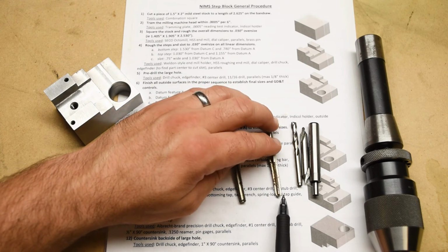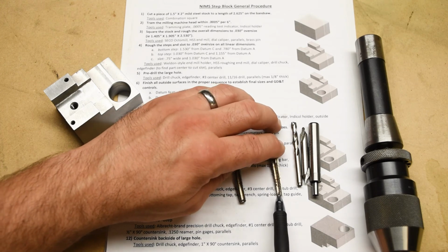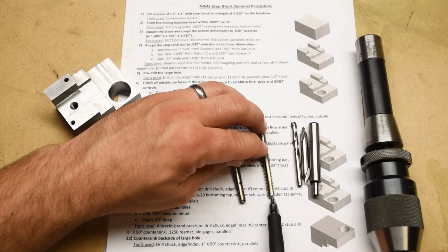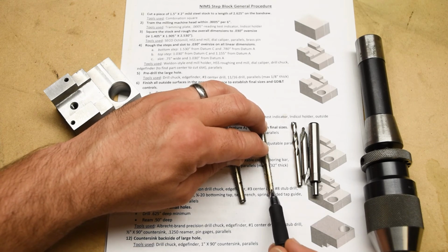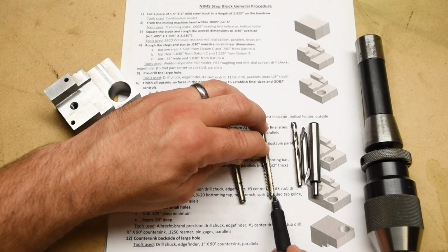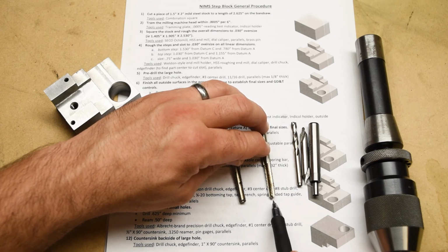So this first one has a plug-style chamfer on the end of it, so it's like 3 to 5 incomplete threads on the end of the tap. This helps it center on the hole and distributes the cutting forces more evenly, but the problem is that you won't be able to get full threads as close to the bottom of a blind hole.